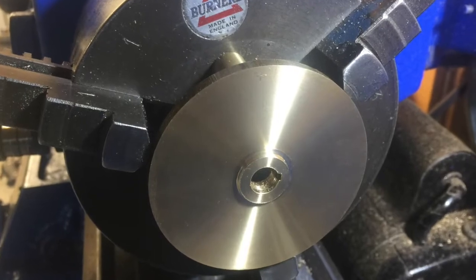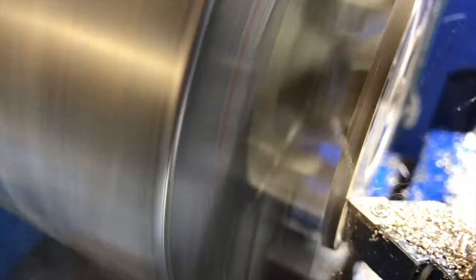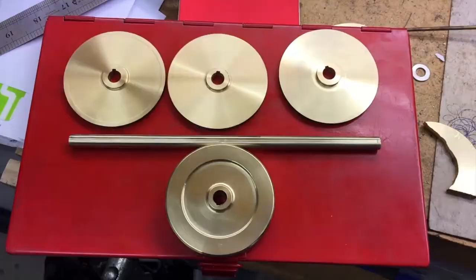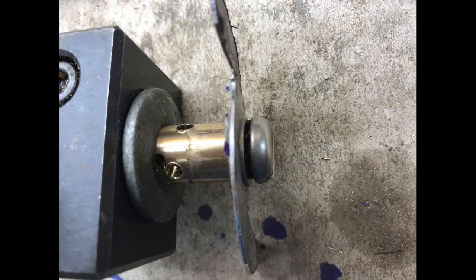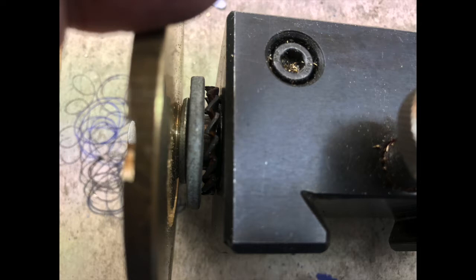The offset on the front of the chuck to mount these thin discs makes cutting them very simple. I thought about this for a year before I actually sat down to do it. What I decided was to use the quick change tool post boring bar holder, which has a hole right through the middle. I placed a shaft in that hole that was allowed to turn. On one end of the shaft I had the pattern, and in the tailstock I had a peg of brass which acted as the follower and followed the cam as I turned it around.